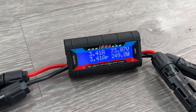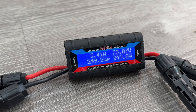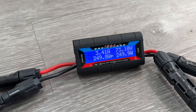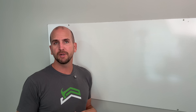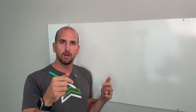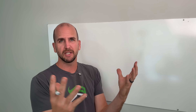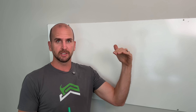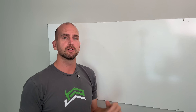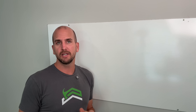Looking at the power meter, we're at about 73 volts and 3.4 amps, bringing about 250 watts. We're almost up on the hour for our first temperature point. I have a few temperature probes in different locations, and also a FLIR thermal imaging camera, which will see the outer skin of that clay pot. I'm thinking this is going to get up to eventually 500 degrees Fahrenheit, but we'll see.